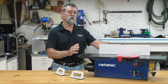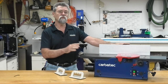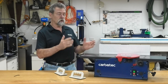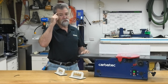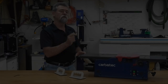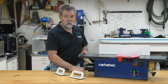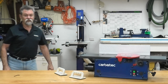Never use the tool in an explosive atmosphere, as normal sparking of the motor could ignite the fumes. Do not operate the machine while under the influence of alcohol, drugs or any medication. Always stay alert. Do not allow familiarity gained from frequent use of the machine to cause a careless mistake. Watch what you are doing and use common sense. Avoid distractions that will take your focus away from the machining task. Prior to starting the machine, make sure the work area has ample lighting and no obstructions. Securely mount the machine to a workbench as described in the user's manual or the optional stand. Never leave the machine unattended while it's running.